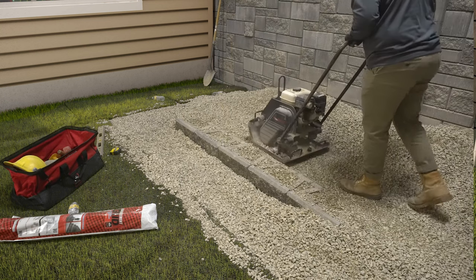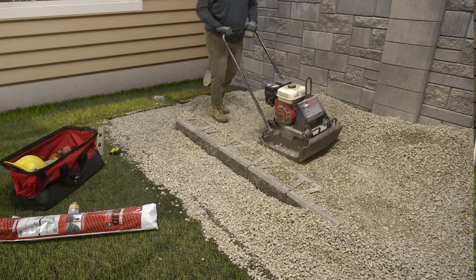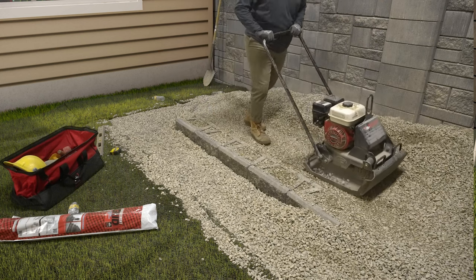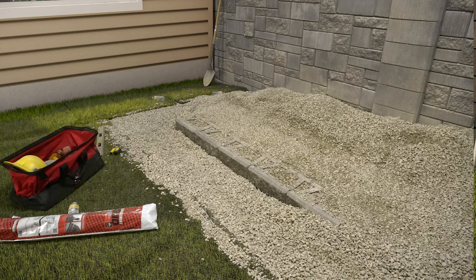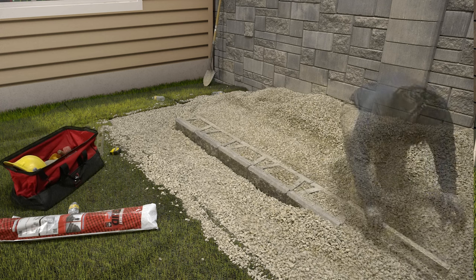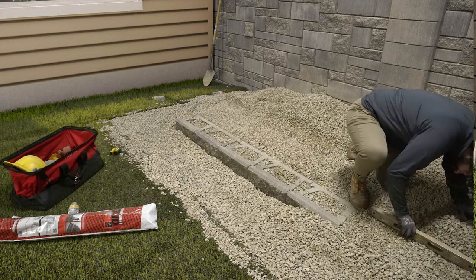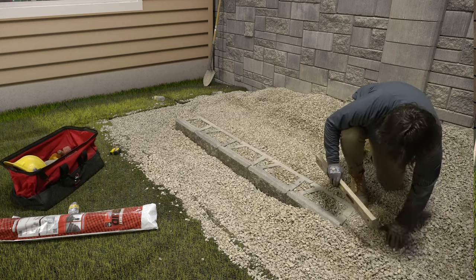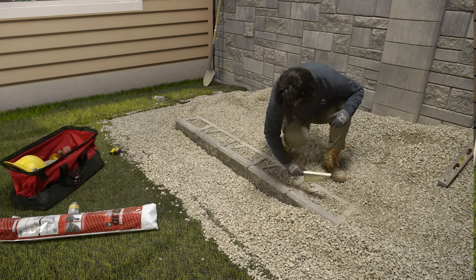With the wall rock and infill soils in place, run a mechanical plate compactor over the location where the step up or second course will be and behind the blocks of the first course in a path that is parallel with the wall. Make a minimum of two passes for each section. Ensure your step up base foundation is level with the first course of blocks and compacted well. Take care not to move the first course. Sweep the top of the blocks clean.